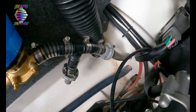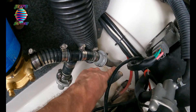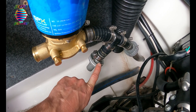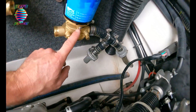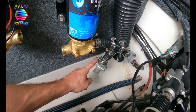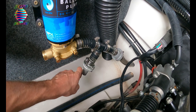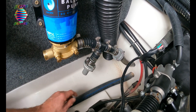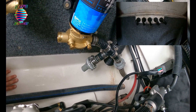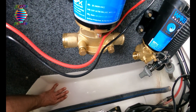Everything's hooked up — let me show you the components. This is our fresh water coming in — this is a check valve that lets water come in to the pump and then out to the bag. This right here is our discharge. When we flip the pump in reverse, water is going to come out through here. That's why this check valve is oriented this way and that check valve is oriented that way — water can only go this way, and water can only go that way. This line runs to our through-hull fitting that we did in the previous video on the vents, and that's our drain. This other one goes to the bags. We need to do this one more time for the second pump and we'll be done.